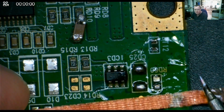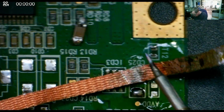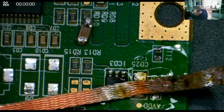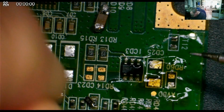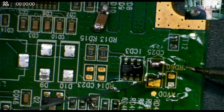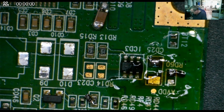It's actually stuck to the board slightly, so I have it set back onto 380. Maybe it wants a little bit of a boost to do this. No, it's done it pretty well actually. Let's also do this one. So this is the larger pad. Yeah, so that's cleaned up okay. Now let's add a little bit of fresh leaded solder to both of them. Okay, and then we'll try and solder some components back on.